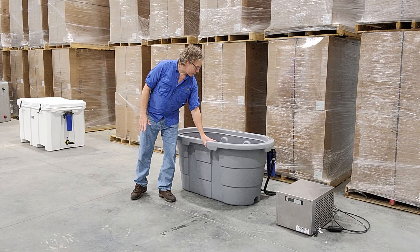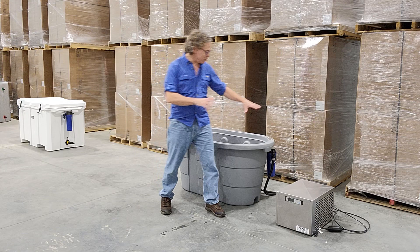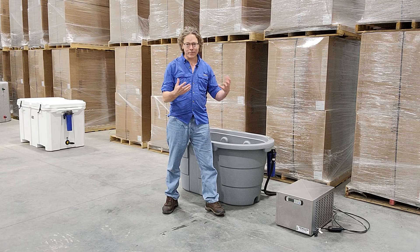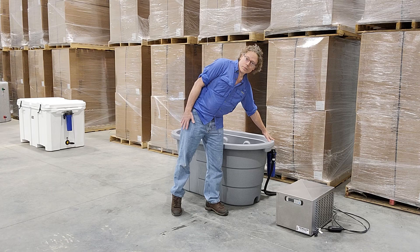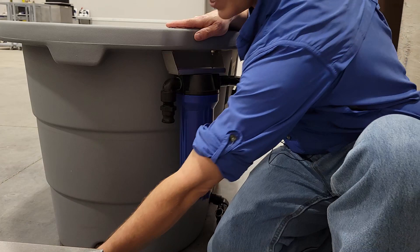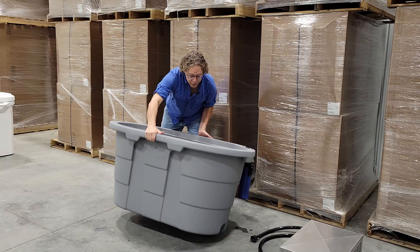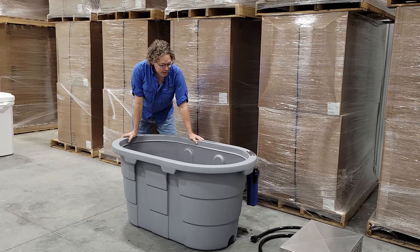This is a three-quarter horsepower chiller putting out 7500 BTUs of chilling capacity. It has awesome quick disconnects with the hoses and the pump is built into it, so you don't have to worry about connecting a separate pump or dealing with all that plumbing — it really eliminates a whole other set of complexities. The hoses go into a filter that's mounted on the back of the tub. These tubs are also very easy to move — roughly about 30 pounds — so easy to get into place and move as you need it.